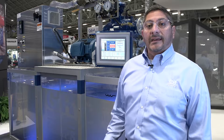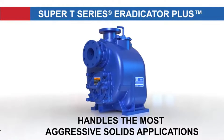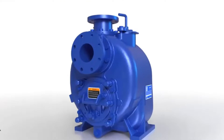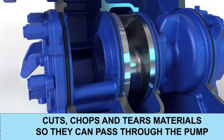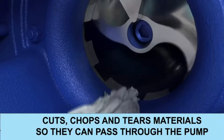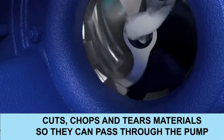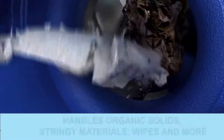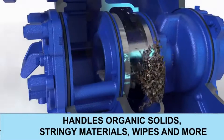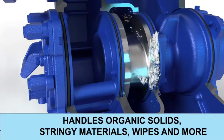In addition to that, we've introduced a proprietary software system called FlowSmart, which is a reverse operation should our pump actually see some clogging. Our real focus today is to talk about our Eradicator Plus solids handling technology, which we introduced this year in June. It's a more aggressive wear plate with a continuous vane impeller made of hardened material to handle more aggressive organic solids we're seeing in municipal sewage today.